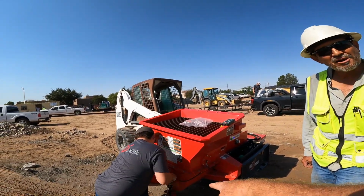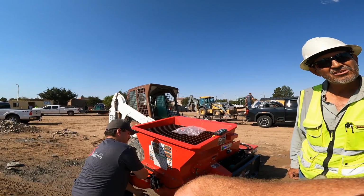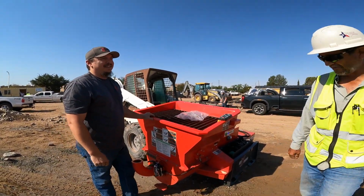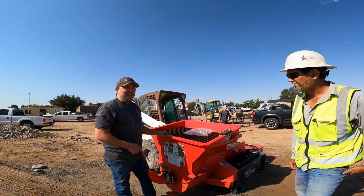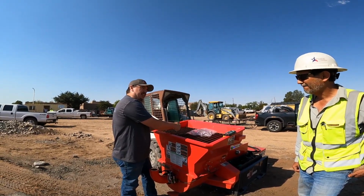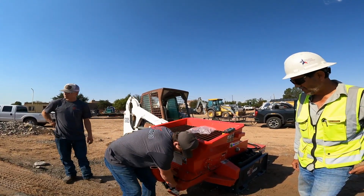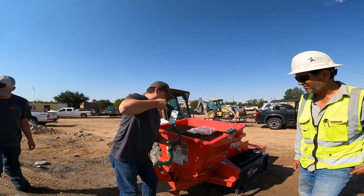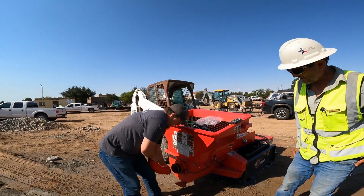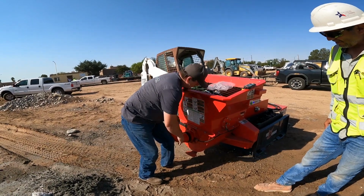Always put your handle side down on your clamp. That way when you clamp it, the handle comes up over the top. You'll do that even on hoses and stuff. You see how I rolled the top edge past the lip and had the bottom out as a lip, like a shelf. So if you're doing that, right? This lip is there, so it acts like a shelf to hold it. Okay.